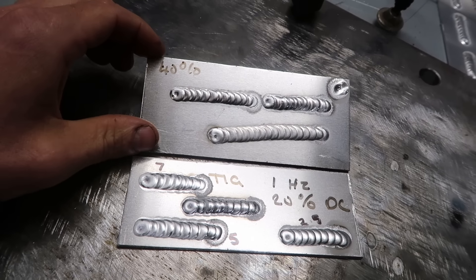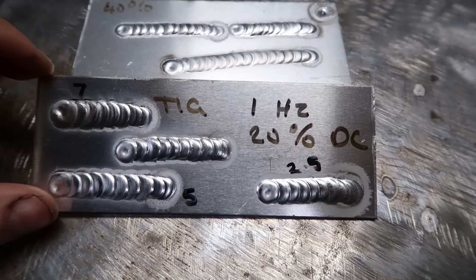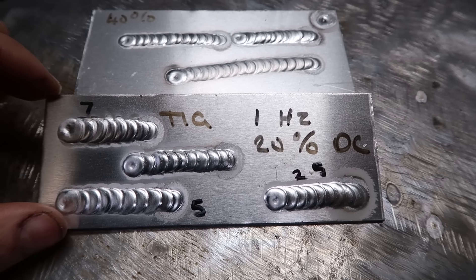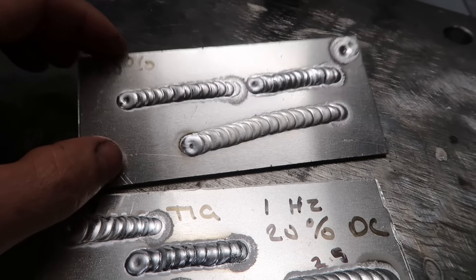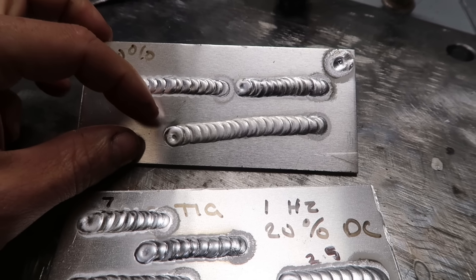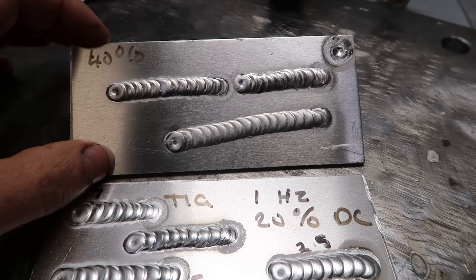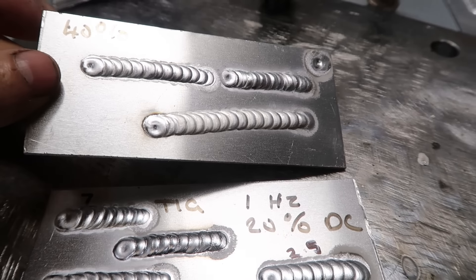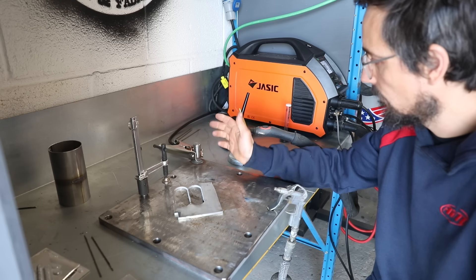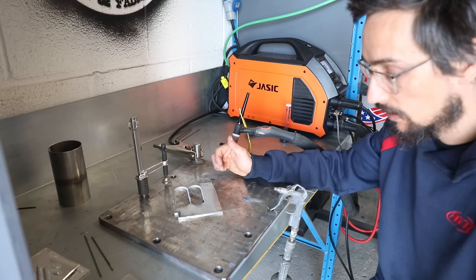Had a bit of a play around with the mixed TIG. There's a lot you could do in terms of playing with different settings between the hertz and the percentage AC to DC. The more DC you have, the more unstable it seems as you're welding. That was with 40% DC, but the spread of heat seems more consistent. Generally the heat will start to run away and you keep backing off as you go along — with this one it seemed like I was just holding a consistent pedal and the heat wasn't spreading. So for heat management it could be really good. I'm going to try it on some 6mm aluminium — run a bead with normal AC TIG, cool it down, then run it with the mixed TIG and see if I can notice any difference.